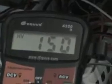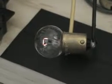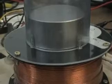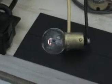We are now at 150 volts DC input. Duty cycle is approximately 2%. The bulb is approximately at the same intensity. The magnet is starting to show signs of lifting — difficult to see on the video, but I can tell it's getting closer to launching. Our resistor is above 52 degrees Celsius, utilizing the same amount of energy.